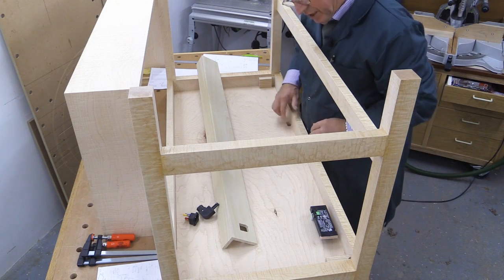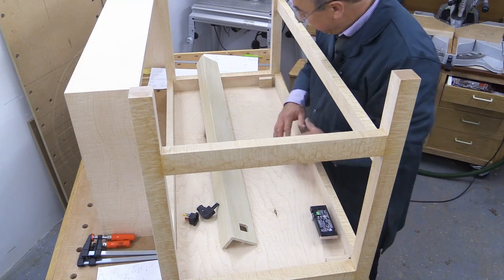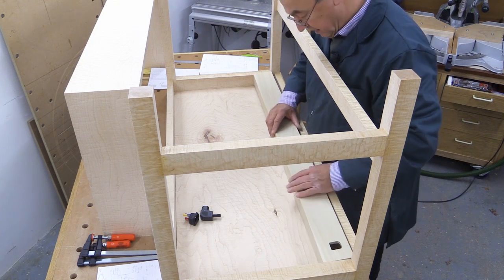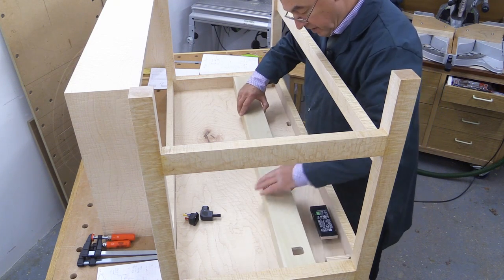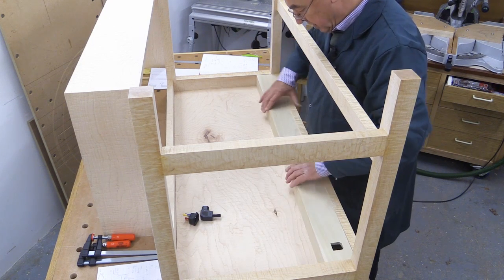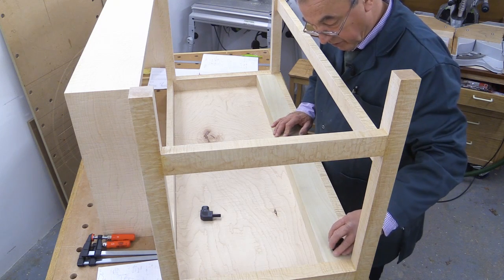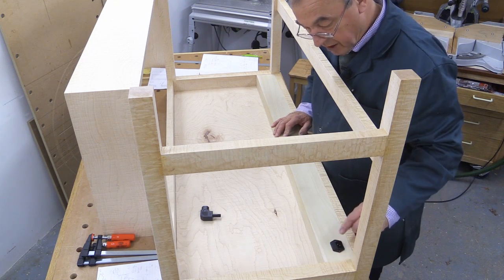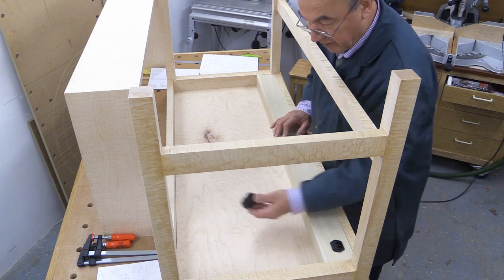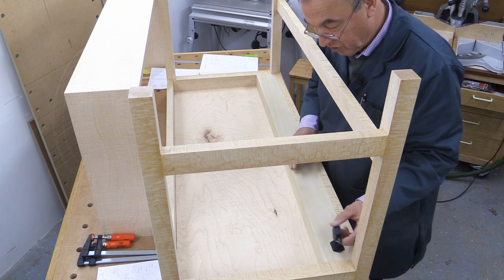I've just trimmed the inside of this last hole. Now I'm having a cover over the whole of this area — I've made it already and it fits something like so. There are supports in three places for it so it can be screwed in place, and there's then no risk of a child opening the cover to expose the electrical wires. I've got my built-in plug there which allows this roving socket to plug into it for the supply of electricity.